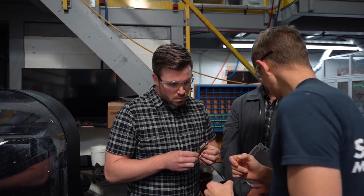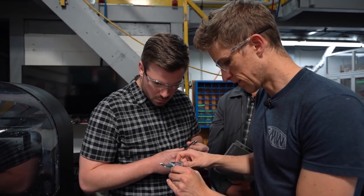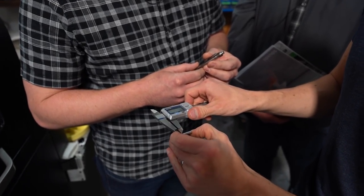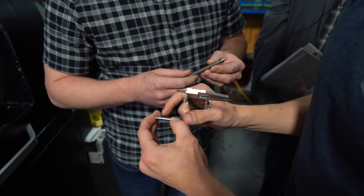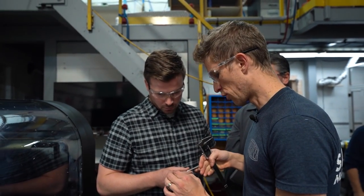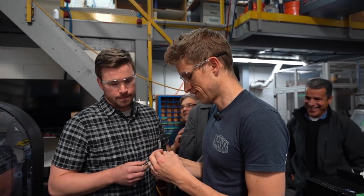Like, here to here, I don't really care about the finish. So I went kind of faster, and then here to here, I slowed it down way slow, because that's where the three ball bearings grind on. Okay. So the better finish there, the better it feels as you're pushing that button. So I programmed it to go fast, and then slow down right there. And it worked amazing.